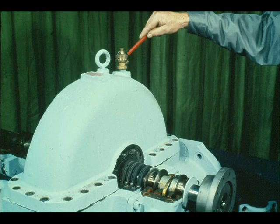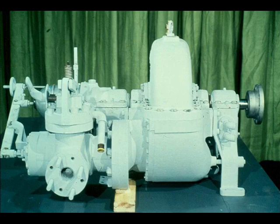This is the only remaining part we will acquaint you with in this segment — the sentinel valve. It is designed to warn you if the steam pressure in the case exceeds safe operating levels. This valve is only designed to warn you; it is not meant to be a relief valve. That completes our brief look at the construction and nomenclature of this particular turbine. We have covered the major parts, and from this point on it is a simple matter to refer to the manufacturer's manual if you have any questions.